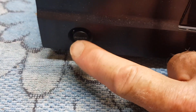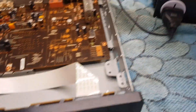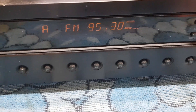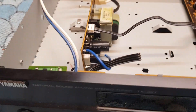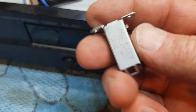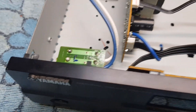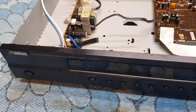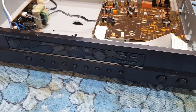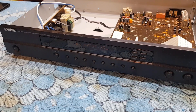The switch is in, mechanically works fine and it stays in, whereas the other one didn't. We'll power the unit up, turn on the supply, turn the switch on — and there we go, beautiful, operational, all fixed. I did check the old switch: it was 250 volts and about 4 amps, so the one we put in was rated 5 amps. You can't go under the original rating, but if you're over it, it'll handle the load easily. All fixed — I can put the cover back on.